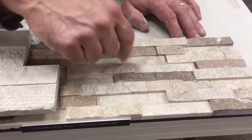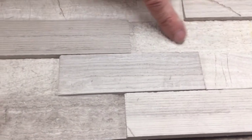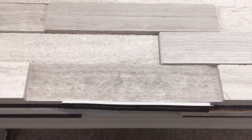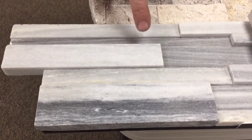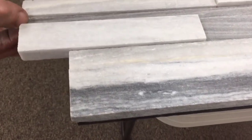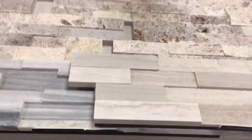In this particular one you've got kind of a honed finish as well as a split finish. But check out this one — you have the split finish, but then you also have the bush hammer, and then they saw it, and then these are honed. So you get this 3D honed — the surface is sawn and then honed, so it's not shiny but it's nice and smooth. Notice it's different thicknesses — this might be close to an inch, this one maybe a half inch, this one maybe three quarters. So in these 42 different choices, you have to consider the finish as well as the color.